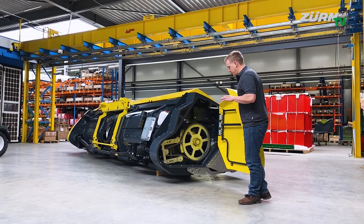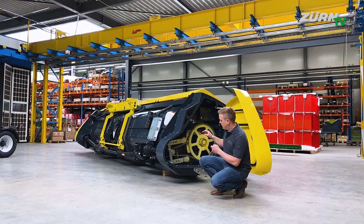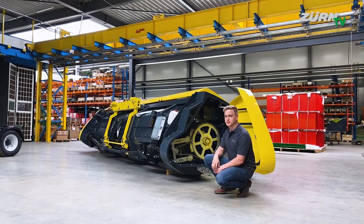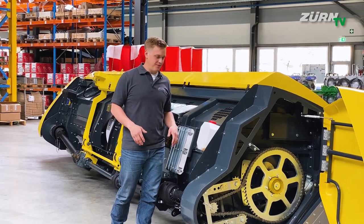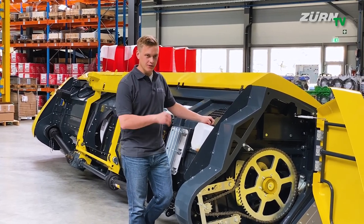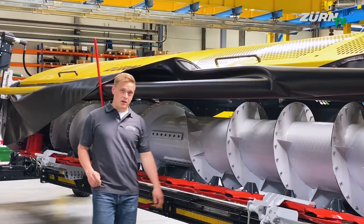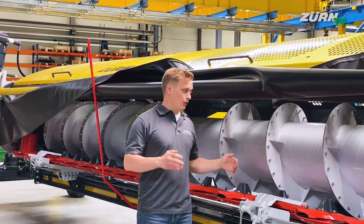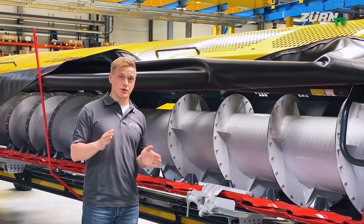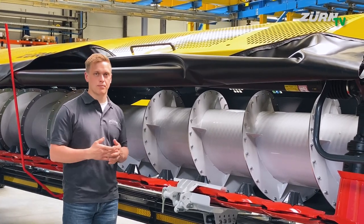When we now open the right hand side door of the PROFICUT, you can see the massive auger chain drive. The automatic chain tensioning system keeps the chain tension right even when reversing. For high wear life and optimum uptime, we have an automatic chain lubrication system — a small pump permanently adds oil to the auger chain. We have a huge 800 millimeter auger in the PROFICUT with large auger flights to handle even high throughputs and feed the chopper evenly.